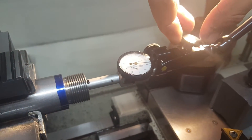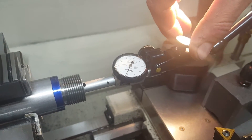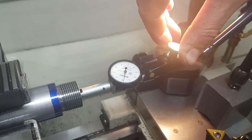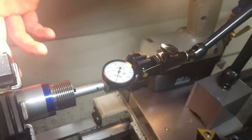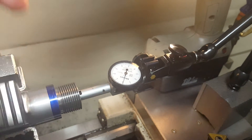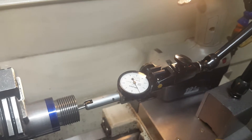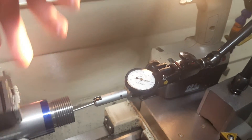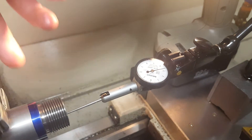Now I'm going to come back and show you the chamber into the gun. The needle movement is what matters — you want all this stuff concentric with the axis of the lathe so your bullet is concentric. Right now the needle is sitting on zero. It's going to move because of the angle of the case and the angle of the chamber. Coming back about halfway — the needle is just sitting there. Same thing all the way to the end, right where the case first goes in, and the needle is just sitting there.